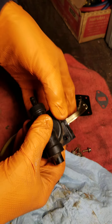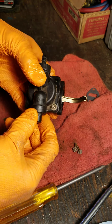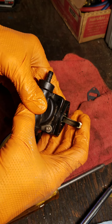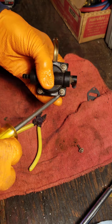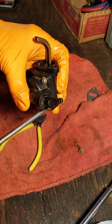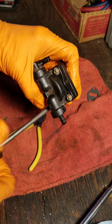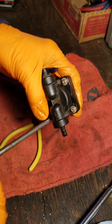We'll squeeze that together and put a couple of screws in and it'll be ready to go. I put two screws in first to check and make sure we get the right pumping action — you can hear it — and everything is operating properly. Then we go ahead and put the rest of the screws in, snugging them until we get them all in. Because of slight misalignment we can move it around just a little bit as we go.